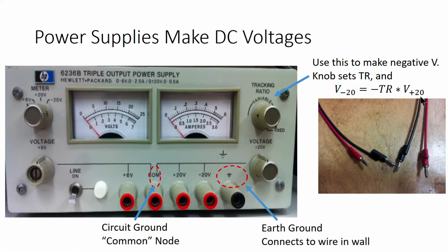You usually connect to the power supply with banana clips that are pictured here, but BNC cables and gator clips work just fine. Just make sure that you don't hook up a power supply with long, narrow pieces of wire pulled off of the wire spools in lab, just because that's likely to cause noise and stability problems in your circuit.